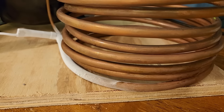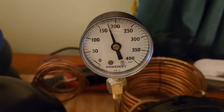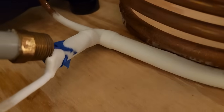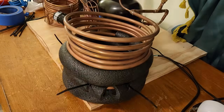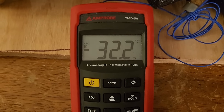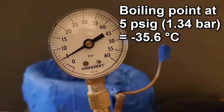One of my favorite parts about this machine is watching the frost form on the evaporator coil — this is about the only way you're going to get snow in Florida. I've got the condenser running at close to 200 PSI and the evaporator close to zero, so the cold end should definitely be close to minus 42°C, but it's only showing about minus 7°C. My guess is that this is because of the lack of insulation on the evaporator coil. To remedy this I added foam around the tubing, and when I ran out of that I finished off the rest of the coil with some fiberglass insulation and covered that with tape to keep it from crumbling. This time I got much closer to my goal and settled at around minus 32°C. This makes sense since I averaged a little more than 1 bar on my evaporator pressure — usually about 5 PSI gauge, which corresponds to 1.34 bar. At this pressure the boiling point of propane is minus 35°C and we're within about three degrees of that on the outside of the tube, so that seems about right.